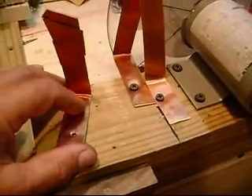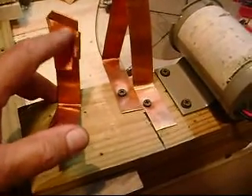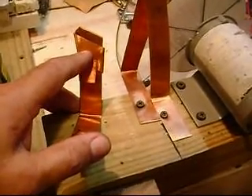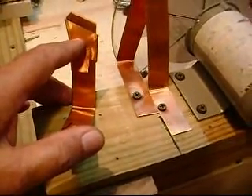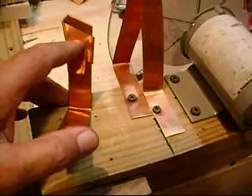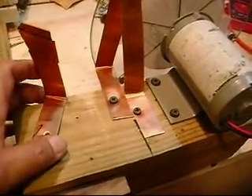Even out into here was 128 to 130. But up here at the top, where the thicker copper was, it didn't get that high. It took me a few minutes to figure out what was going on. My magnets aren't heavy enough to get into the copper enough to cause an eddy current, is what it actually is. So after messing around a bunch with that, we went to one piece.